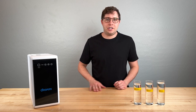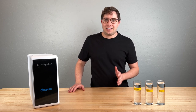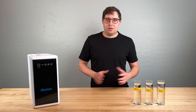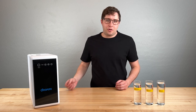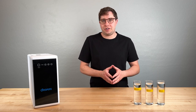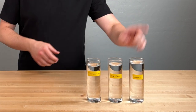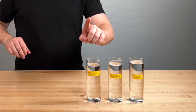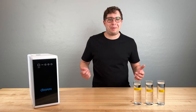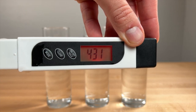It is very difficult to measure and test contaminants outside of a lab, and sending away water samples takes a couple of weeks and costs a couple hundred dollars. So we're going to get by with the information that I have. Let's look at basic TDS testing. TDS stands for total dissolved solids, which is just a fancy term for the mineral content of the water. I've got three samples here: tap water in the middle, water from the DePuro filter, and water out of my WaterDrop reverse osmosis filter for comparison. The tap water has an extremely high level of minerals at 431 parts per million.